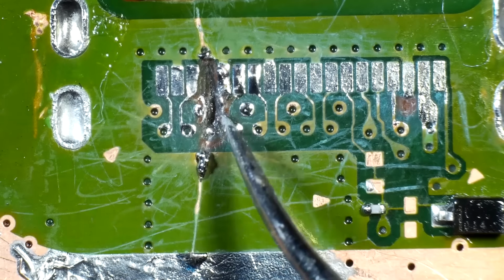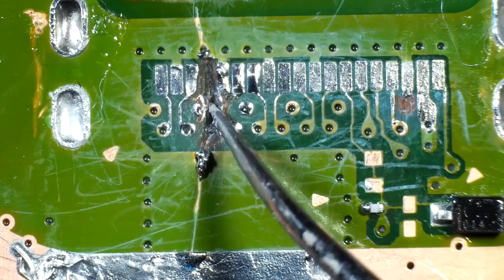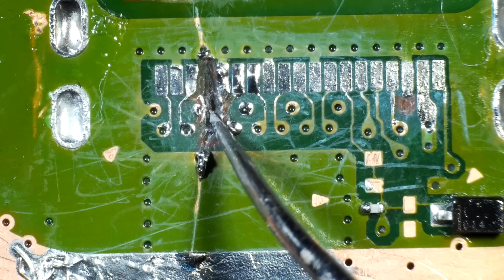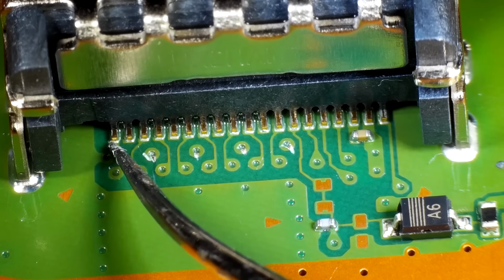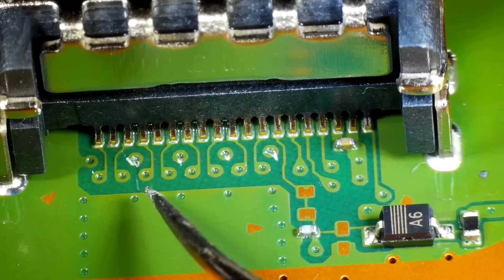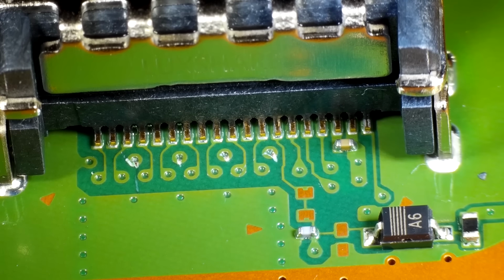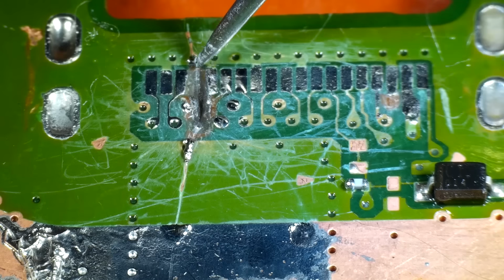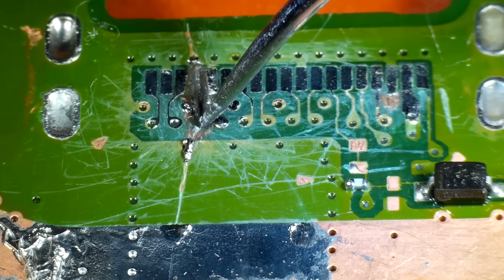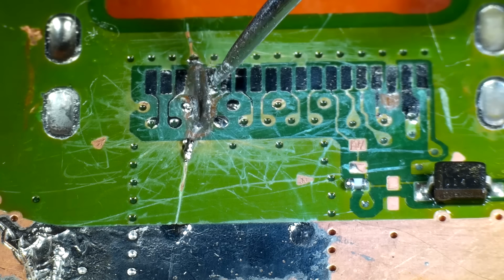And I can confirm that there is definitely what looks like a significant hole in the board right here. So this is an HDMI port on a PS5 that is obviously intact. I'm looking at this because I need to make sure that the pins on the new port that I install are installed correctly. So we're missing one pin right here, and this pin would be connected right here. This one goes right there, that one's ground.